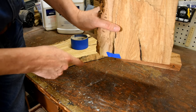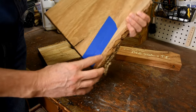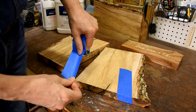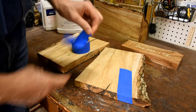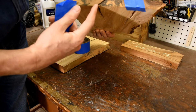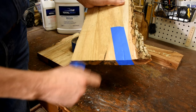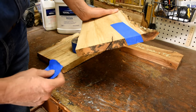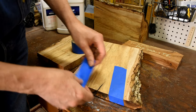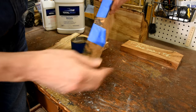It's important to make sure that if there's any leakage at all, it stays contained right where you want it. I fold the tape over on the top to make sure it doesn't come loose, leaving a gap where I can pour the epoxy in while preventing any spillage. If there's any debris in the cracks, I recommend trying to get it out. I cleaned mine out with a screwdriver and a hacksaw blade slid into the crack, then blew it out with a blow gun. Any remaining material — the epoxy tends to soak into it and seal it up with the rest.